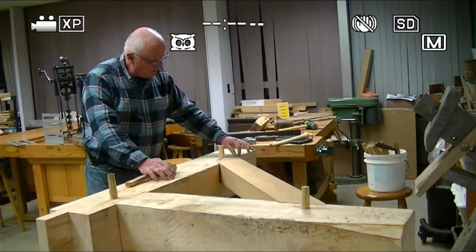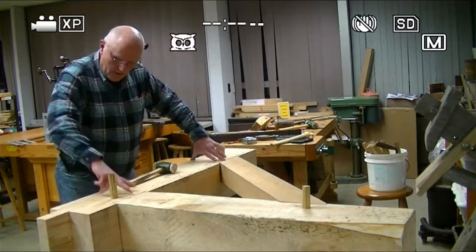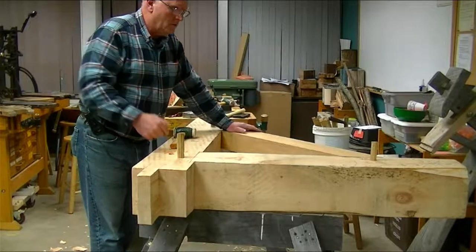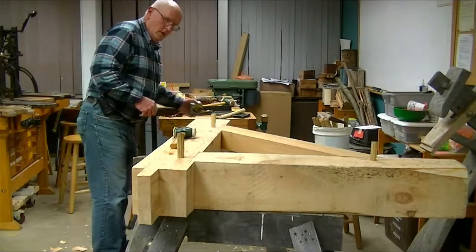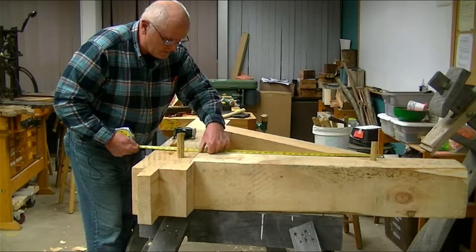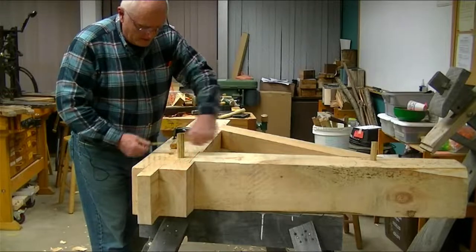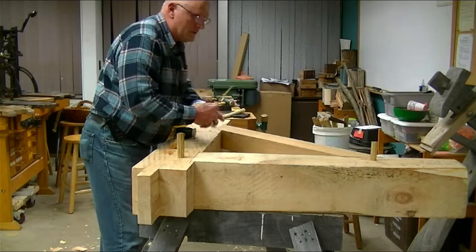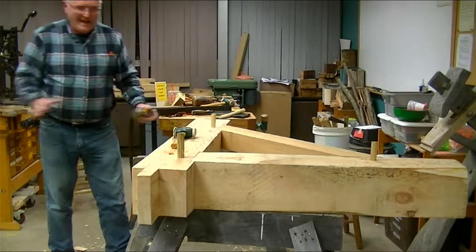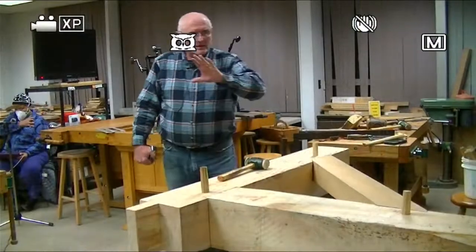Let's take a step back and talk about these housings again. These housings allow this to be a uniform dimension here and here and here. By doing that, I am standardizing the timbers. All the braces are identical because this is a 30-inch brace going from there down to here — 30 inches — and from there over to here — 30 inches, right to this edge of this timber. When it comes to the housing, I have an 8x8 and I let it down to 7.5 and 7.5. So it's all uniform. I know my braces — if that's a 30-inch brace, it'll fit anywhere a 30-inch brace needs to go in a building. If it were scribe rule, I would have to scribe that brace into the post and the tie, and that's the only place it could go.